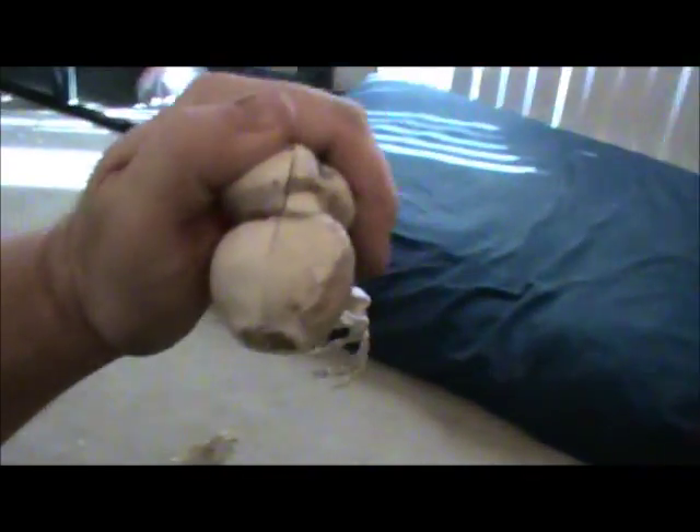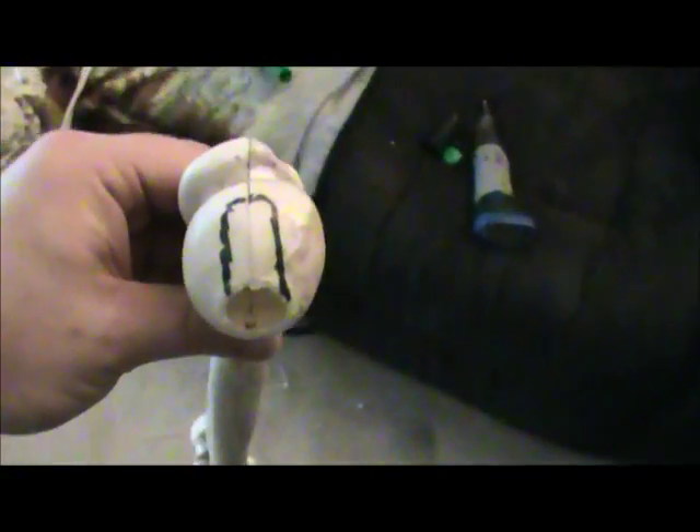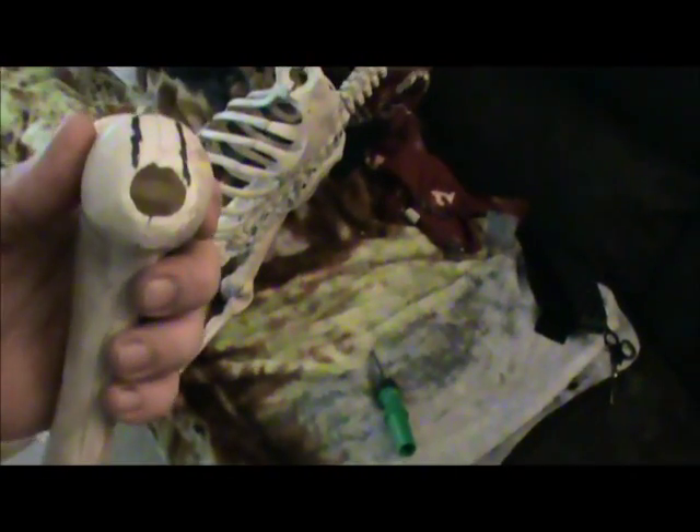I'll outline it in Sharpie — so that's where we're going to cut. I'm going to use a Dremel again. Now there are little bumps inside here which you're going to have to smooth out, which means you're also going to have to take apart this arm. So you're going to need to unscrew those three screws — this one, this one, and that one. You won't need to undo the others entirely, but these three screws you'll need to remove pretty much entirely so you can separate the two halves of this arm.